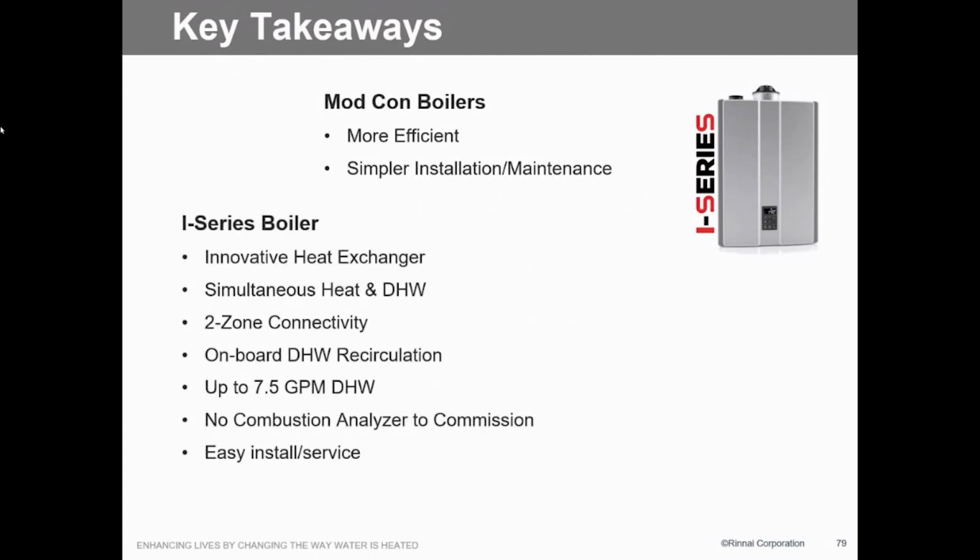New heat exchanger design because of the stainless steel and the brazed plate heat exchanger for the secondary. That's a big thing. And then, of course, the brazed plate heat exchanger for the domestic water if you used a combi. That's another big thing because for fouling, for hard water areas, probably not going to be as critical as we've seen in the past.